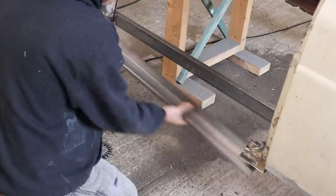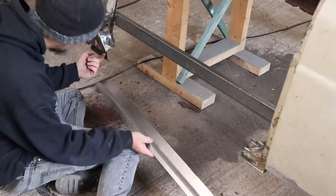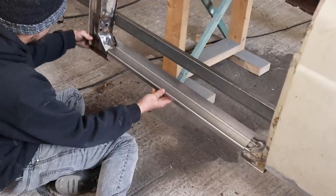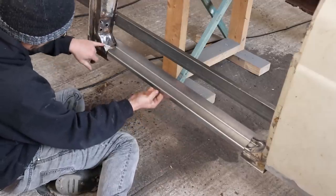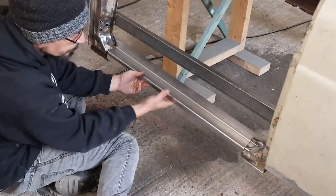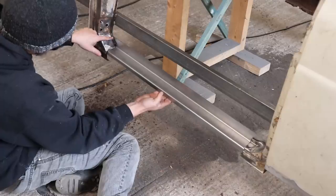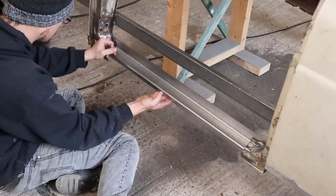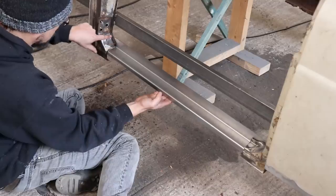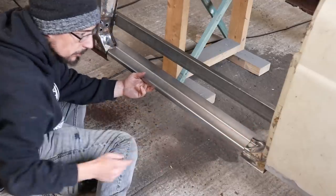So I've got this — I need to drill these spot welds out, pull this little piece out here, and then that will sit tight in behind this panel here. Same there. And this is all welded straight into this. I'll actually cut this lip off of here because I need to replace that little piece there, just because it's rotten. And I'll do the same there, so that I'm using more of the new steel than the old steel where I can.